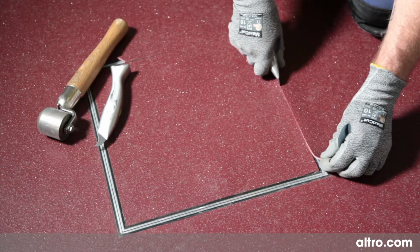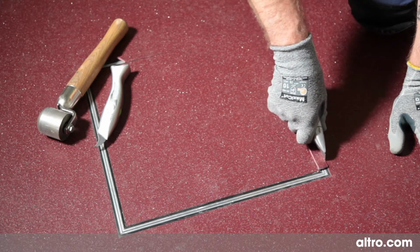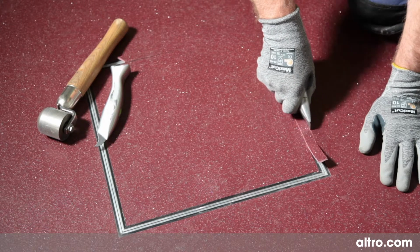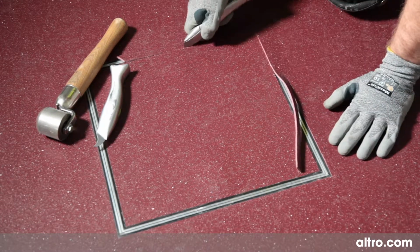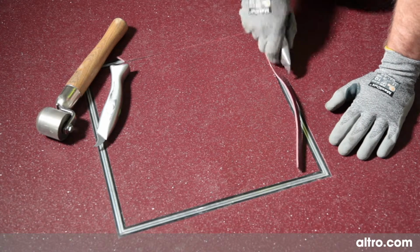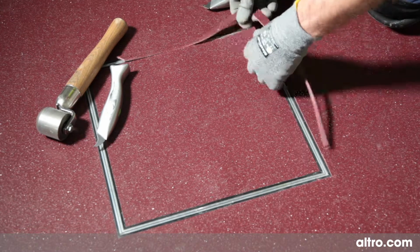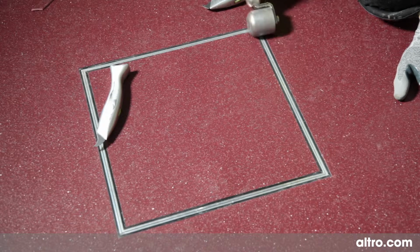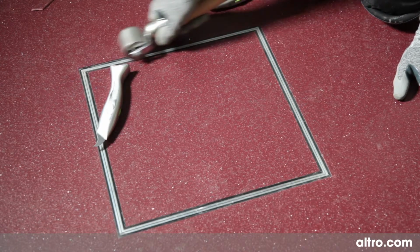In order to obtain the correct finish, all manhole or access covers within the floor area must be designed with clamping or weldable edges. This weldable access cover is rebated to the thickness of the flooring. The material is fitted tightly to the edges, then grooved and hot welded to the PVC insert, both inside and outside of the cover, providing a neat and effective watertight seal between the floor and the access cover.